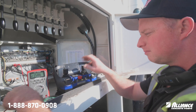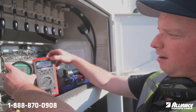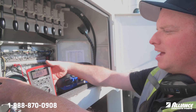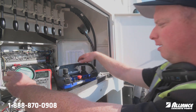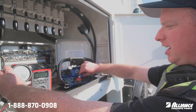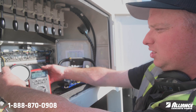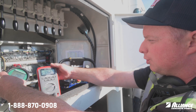Then we're going to get our pressure. You can see that at minimum output is where our highest pressure and our highest current is going to be. As you dial the remote up in speed for testing purposes, you're going to watch these pressures. At about 55 or 50%, we're at just over half the current and just over half the pressure — so about halfway.